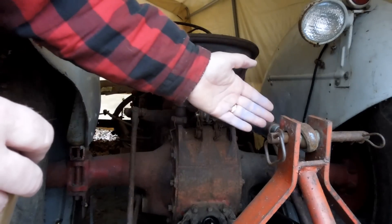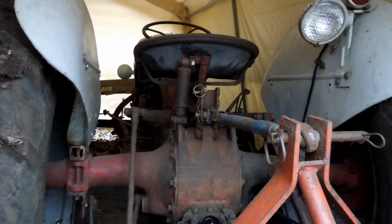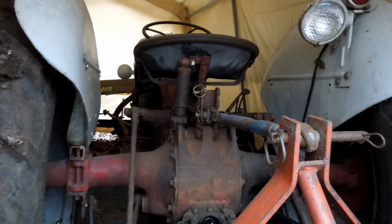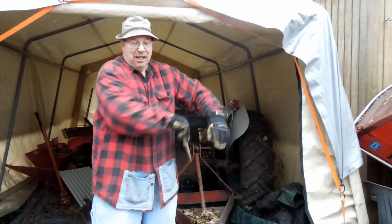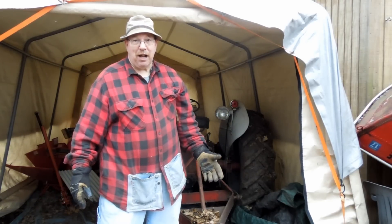So I don't want to adjust the tilt too much, because it's real important to have this go straight up and down. That way, when you lift the hoist, you don't tip the hoist down into the part you're trying to lift and lose all the lift that you gained. Okay, we got the measurements.